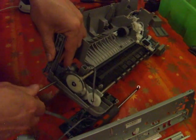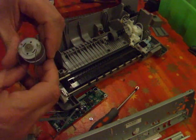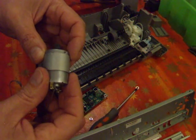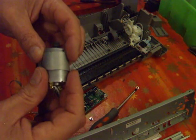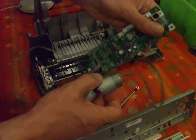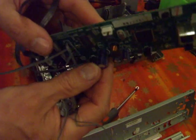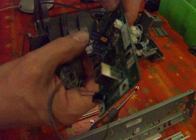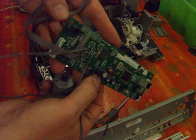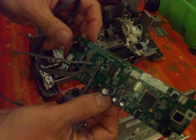I suppose it's a pretty good guess it might be a 24 volt motor, but you never know without checking the electrics. It actually says QK1 0908 RD 885227 01, made in China — which doesn't really help if you want to know what voltage it is, but we can play with that sometime. Looking at the circuit board: a few capacitors — 470 microfarads, 100 microfarad, 100 microfarad — a couple of push switches, and another detector of some sort there as well.